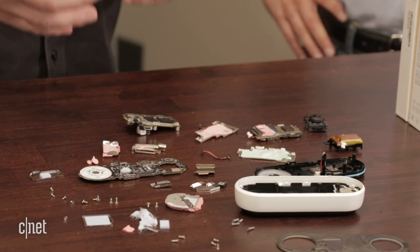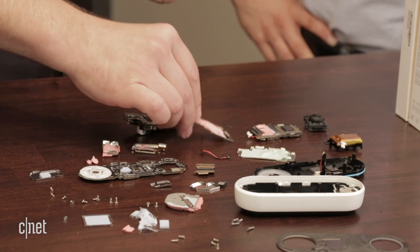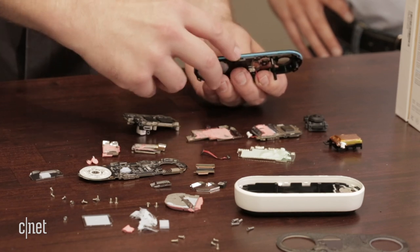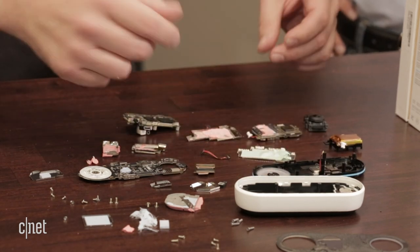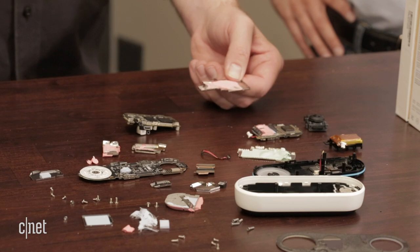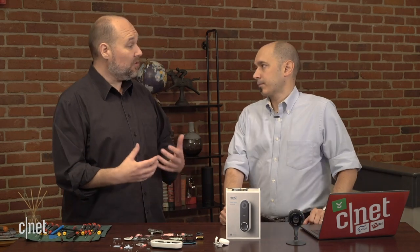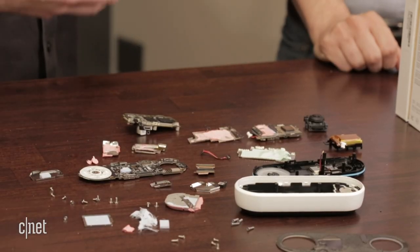This is a device that's designed to go outside, so it's designed to be a little more waterproof than perhaps a cell phone or cameras meant for the inside of the house. It does have an additional rubber or silicone gasket around the outside to help with that. There's also this pink material inside that fills the gaps around some of the ICs. It doesn't appear to be normal heat sink or heat-conducting foam — it seems to be something else. So I'm not sure if that's more for water protection, shock protection, or heating — I just usually don't see this inside devices.